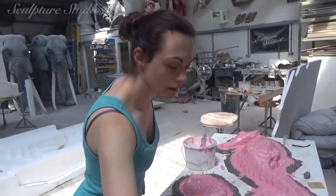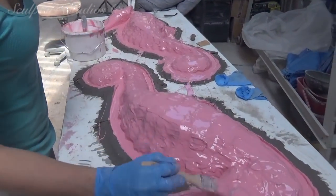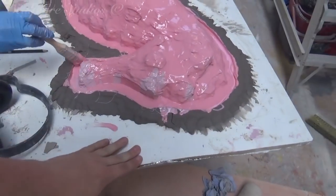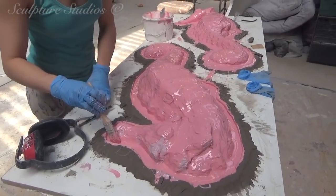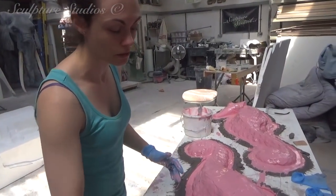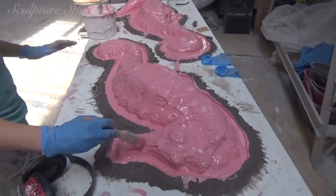So, do you want to tell us what you're doing here, Jess? At the moment, making a silicone mould. We're doing it in two halves, and these halves are never going to actually have to join — it's just so that we can get a really nice quality on each side, and then join them ourselves later with fibreglass. We're doing it in silicone because it releases the fibreglass and gel coat easier. We're currently on layer four — we may go to five, depending on how the next one goes, because we have to take away any undercuts. Even though the silicone does pull around them, it makes it far easier to demould when it's just a solid lump. We'll also give this a fibreglass jacket so that the silicone holds its shape, so that when we take out the main bulk from underneath, it doesn't just go all floppy and fall apart.